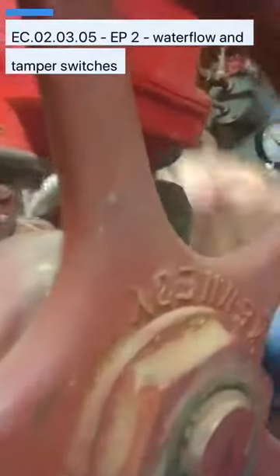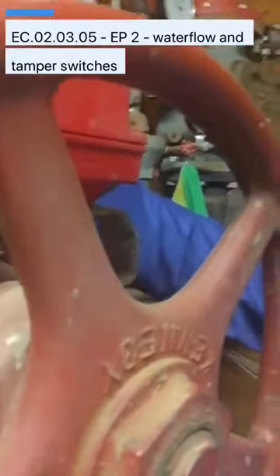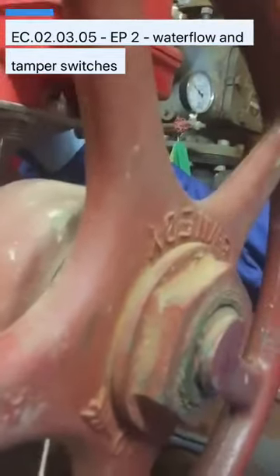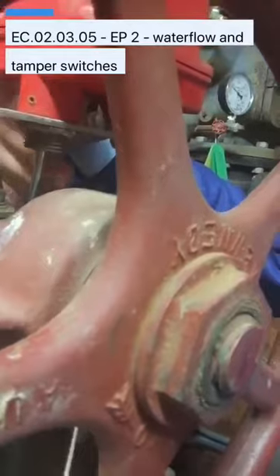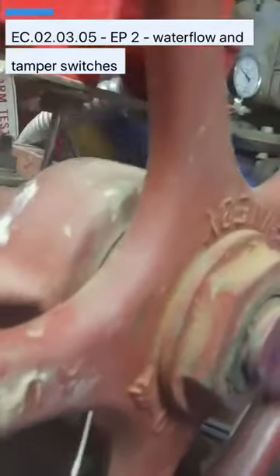And the same applies for tamper switches. So this is a valve tamper switch — we've done a couple of videos before on this. You can see the stem in here. This is our sensitivity setting, and within two revolutions this system is actually shut off because we no longer have this cooling tower. This tamper switch has to activate within two full revolutions of the valve or one-fifth of the stem. If two full revolutions of this tamper switch don't cause it to go off, it fails. So we fail it as a whole system — we fail the valve assembly and the tamper as a system.